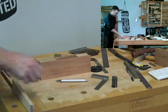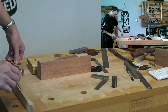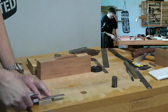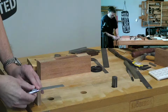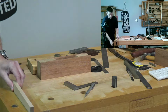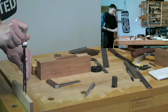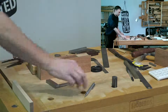So that's given me 7 down this side, so we'll leave one as sole, then a dovetail in that area, and there and there. And you won't see that they're lined up on the other side, but I will square them across. No reason not to. Goodness, that side's as long as the other side.